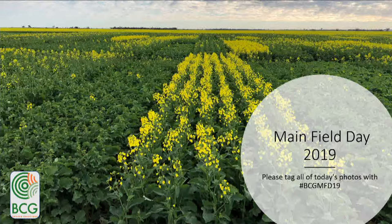The other thing I really want to encourage you to do — who's got sealable silos? Who's done a pressure test on them in the last 12 months? No hands — I'd encourage you to do that as part of your annual maintenance. We often think about silos as something that sits there static, but we forget about maintenance on the silos. I'd encourage you to check if those seals are still going to work, if any seals need replacing, or if any hatches have been bent — the auger sometimes hits the silo. While you're doing it, have a look at your sealable silos and do a pressure test.